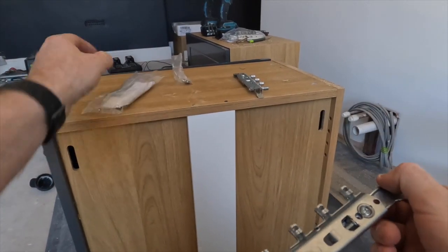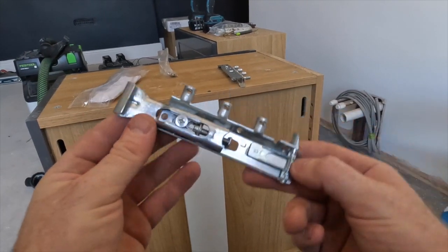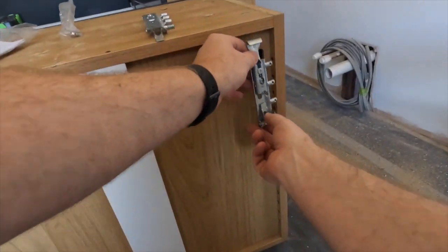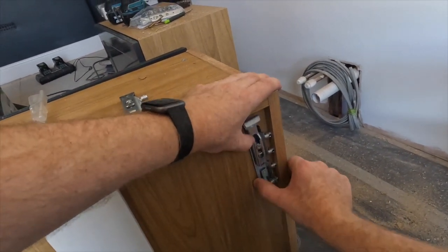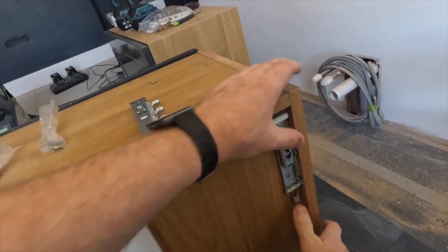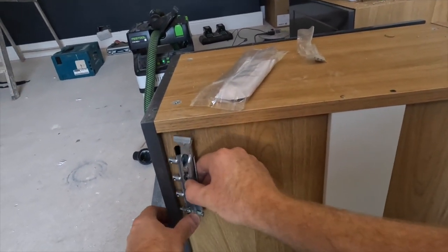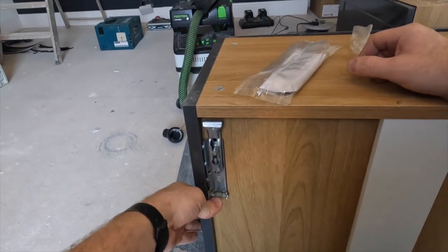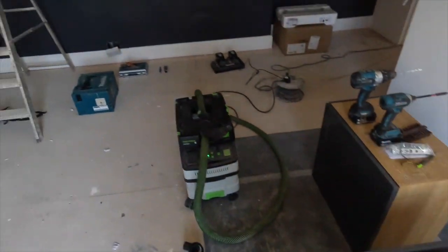As you can see, you've got your holes down the side there, and you've already got a nice little slot that's been routed into the back panel of the units. And that little slot then gives you access with a screwdriver from the front once you've fitted it to the wall to then jack it up or let it off, and also tighten it back to the wall. So it's a nice little feature on these kitchens. Not a lot of other people do that. I don't think anyone else does that. Most people just sort of let you sort that out by themselves. But anyway, going back to the second camera now.